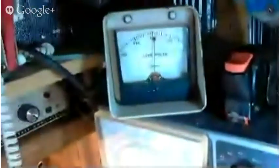And then if I throw this switch upwards, see, nothing's plugged in right now. If I throw this switch upwards, then you'll see this meter go up, which gives me a percentage of the voltage. Right now it's at 100%, so 100% of available line voltage is being supplied. And this meter over here reads the actual line voltage, 121 volts right now. A little high in my shop all the time. So that's just some of the equipment that I have, and that's what we'll be using.